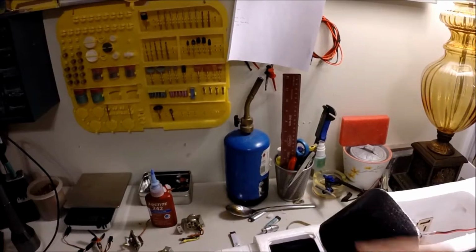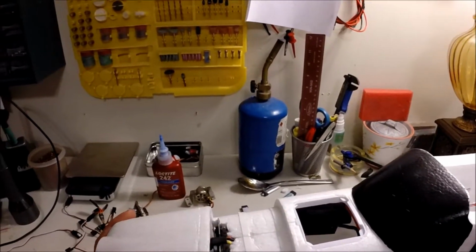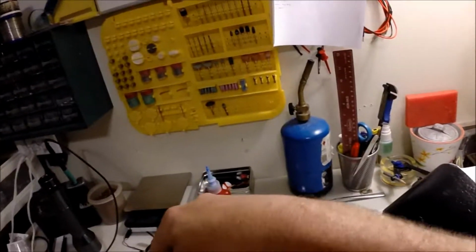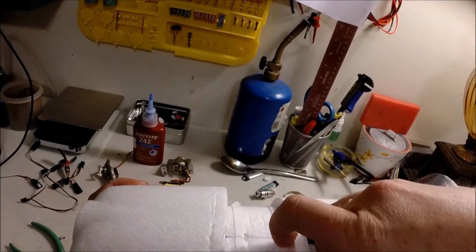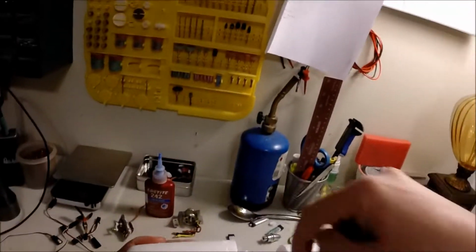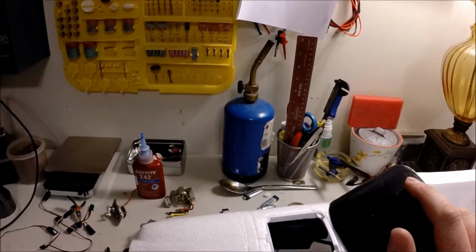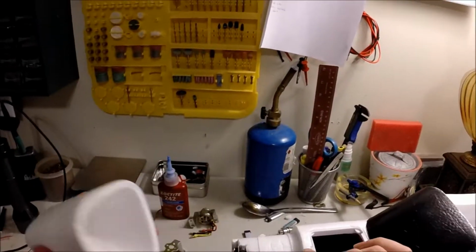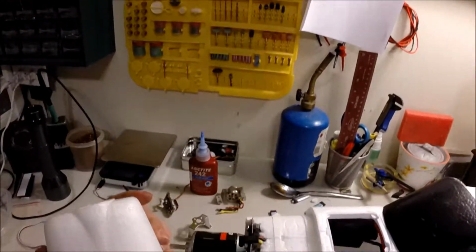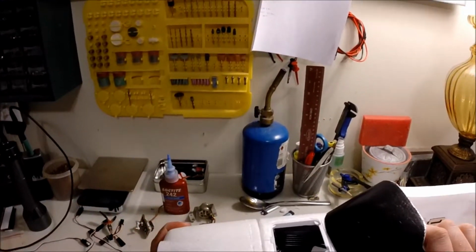For your cowl, I don't use their glue. It sucks, because you'll never ever get it off. So for the original one, where you cut down the middle, I'll fit it, press it real good, and put a bead of glue here, here, here, and the same on the other side. That way it has a nice clean look, and if I ever need to get this off to do anything to the motor, I just make a little cut where that glue is. If you already cut down the middle because you had to get this off, you just put a bead of glue down there and then maybe one in the bottom corners. It holds it on. It's more cosmetic than anything.